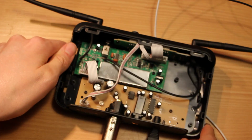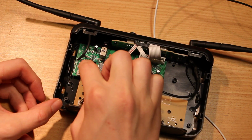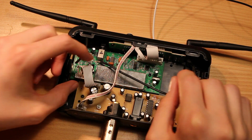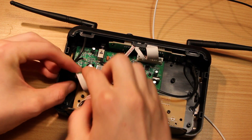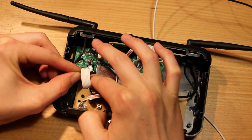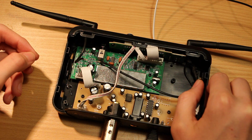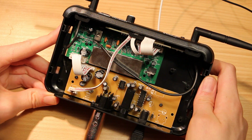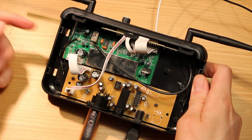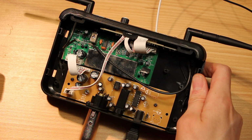I think the next thing I'm going to do, and this one I will do with the power off, is unplug the power, then unplug this ribbon cable, and actually I'm just going to yank this. The voltage regulator's on this side. What's the worst that could happen? That was a completely different kind of hum, I guess. Maybe it just did that because the high impedance inputs on this were floating. I was hoping that would tell me whether the noise was coming from this board or this board, but the fact that it just replaced that with completely different noise made the test not so useful.